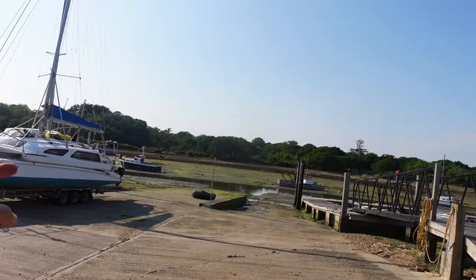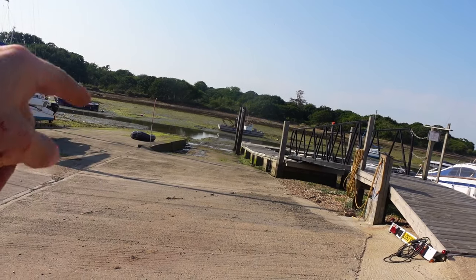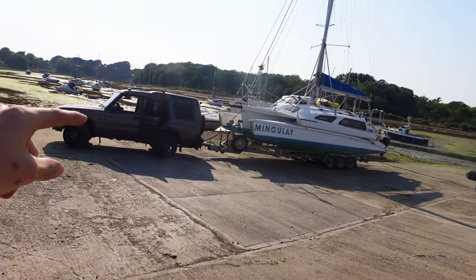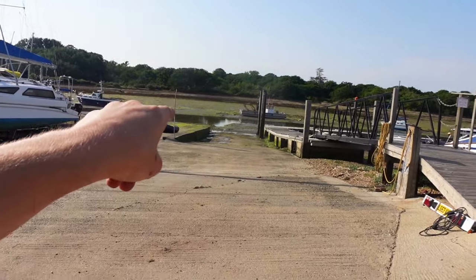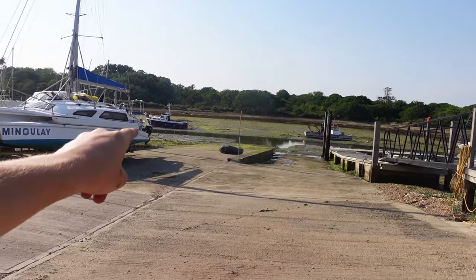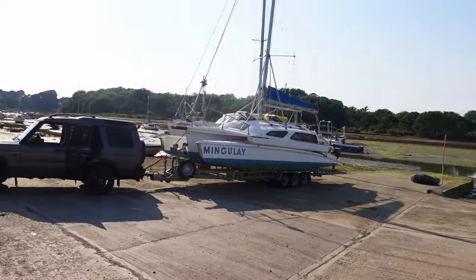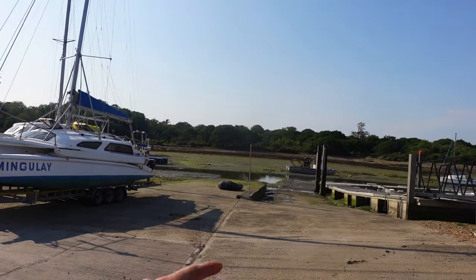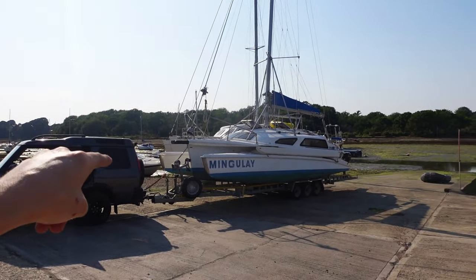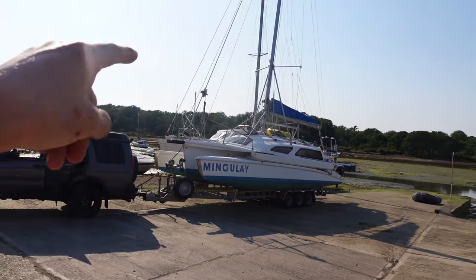I missed this morning's tide so I've been chilling out in the boat sorting things out, but now we're going to try and use this slip here. Because it's the first time I've used it on this trailer and the first time launching, what I'm going to do is back the trailer down into that lower spot. It kind of goes down at 10 degrees and then levels off at 5 degrees — that slipway for reference is at 5 degrees. So I'm going to get right down there before the water touches, get everything prepared — fenders on, lines — and then watch the water come up on a mark on the post where the waterline needs to be for the trailer to float off, because that'd be an important reference for other marinas.